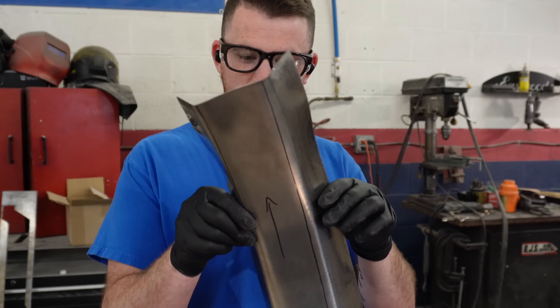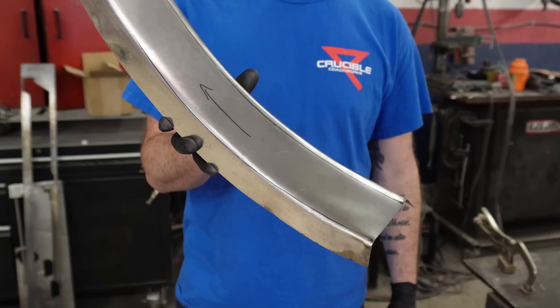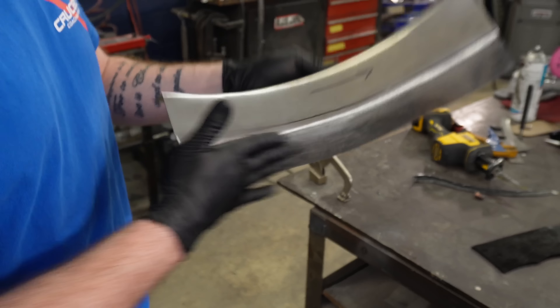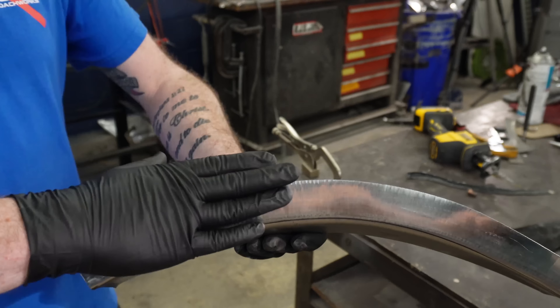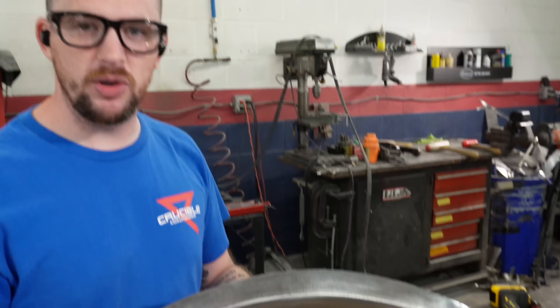I got my shape kind of baked into place right now. It's like a banana - we made a metal banana at this point. I got it roughly stretched, up top and down below. I know I don't have it right, but I have it close. I can't check that until I get the radius back into it in the right form, because when I fold this back over it's going to push it in a different direction. So I'm going to hammer it back on the form to get the shape back into it and see where we're at, because I probably overstretched in some spots.